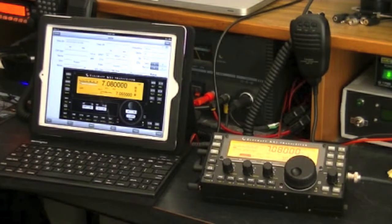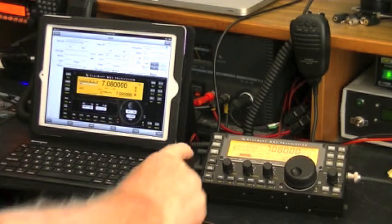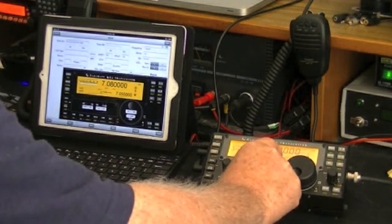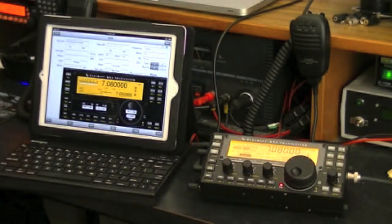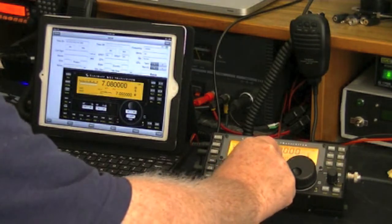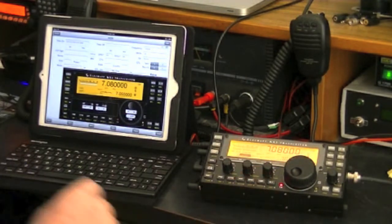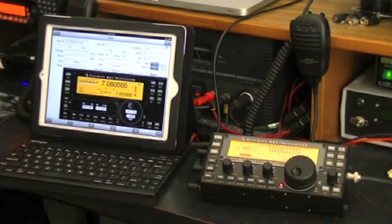What I'm going to do now is a test call by pressing the transmit and observing the level meter on the KX3. This is VK2AWJ, VK2AWJ testing — anyone using the frequency please. This is VK2AWJ testing on the earphone. The microphone level appears to be alright; I'm adjusting to 30. Microphone level appears to be okay.